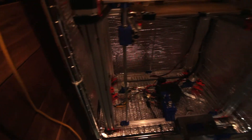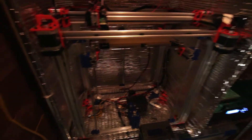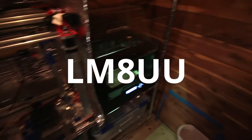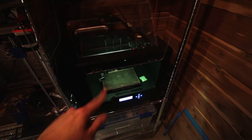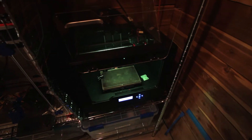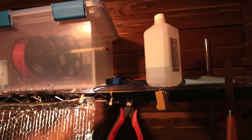I had to do some minor alterations to it. As you can see, there are some linear rods — I'll try to brighten it up a little bit in post — but there are 3 LM8, or 8mm rods with LM8U bearings. Then of course, FlashForge is still soldiering on. That's actually the same PEI sheet I put on there initially — it's still going strong after 2 plus years. I need to replace it soon though, it's getting pretty worn. And of course, I now have a Raspberry Pi which is an Octoprint setup. I might do a video on that, though there are tons of videos on that already.